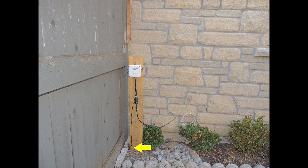I will start at the grounding rod. I connected a ground wire from the grounding rod to the lightning arrester. The lightning arrester is connected in series between the coax feed to my radio shack in the basement and the transformer box. An RG-8X patch cord with PL-259 male on each end connects the lightning arrester to the transformer box. This transformer white box houses the 9-to-1 unun and the 1-to-1 balun transformers. There are two wing nuts on this box — the one on the right is connected to the antenna radiating element, and the other is connected to the counterpoise wire.